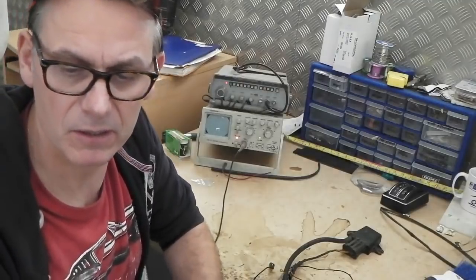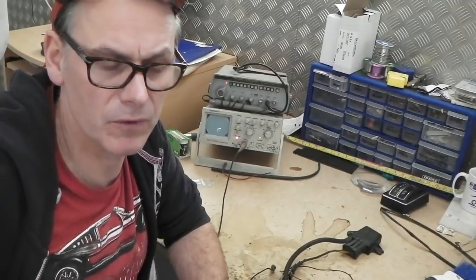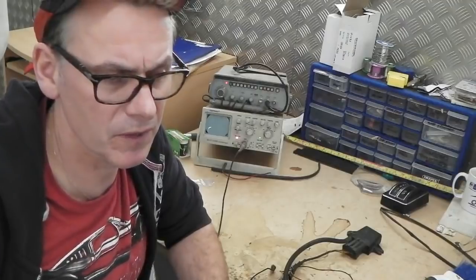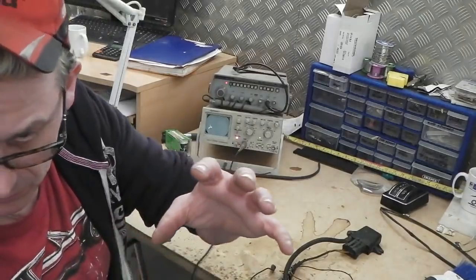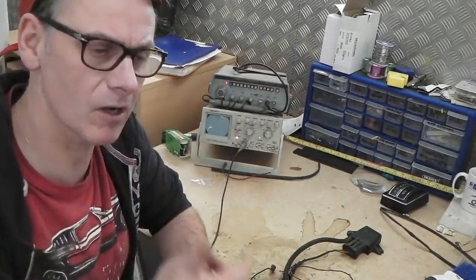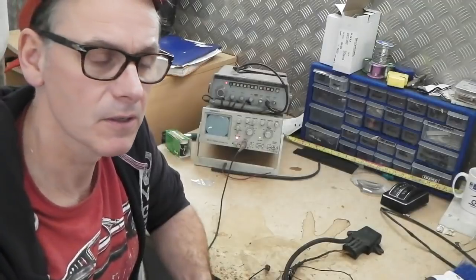So we'll add in a loom to the gearbox, we're fitting a vac switch on the side of the box, teeing into the manifold vacuum, which is great. As long as you're on ported vacuum as well, I found that's the vac point, not on the intake of the carb, but on the other side of the butterfly valves of the carb, what's called ported vacuum, which is what the modulator's controlled off anyway. So that solves that.